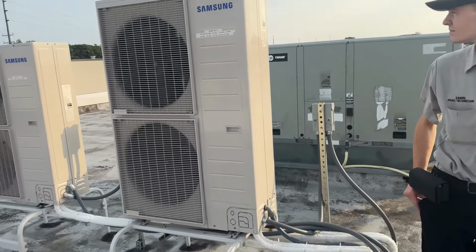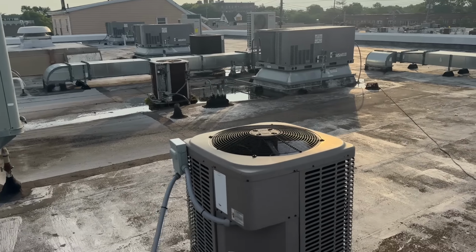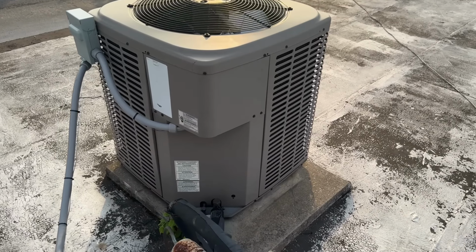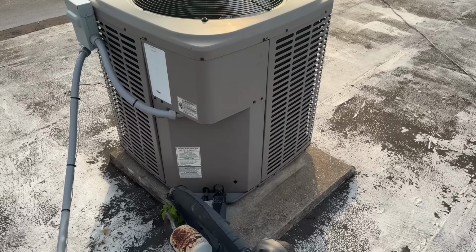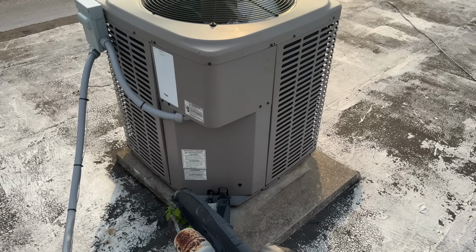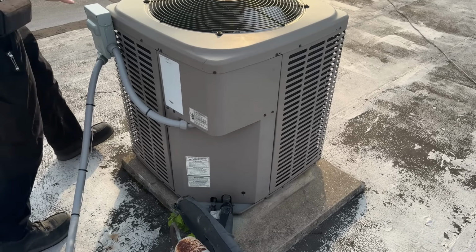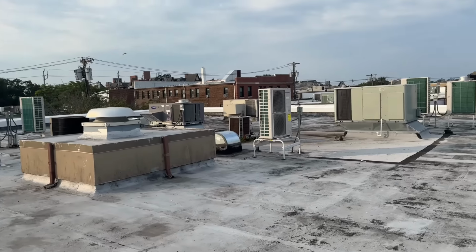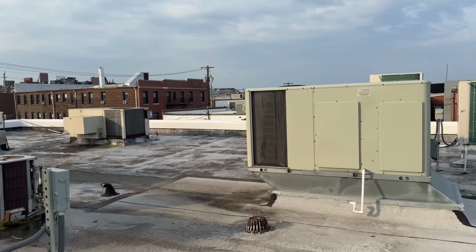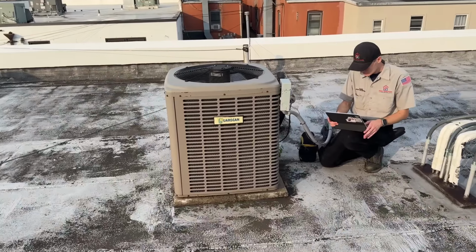What I do know is that the new landlord took over the building, renovated it, and I guess stuck her with this while everyone else got new equipment. It stinks. Yeah, it does stink. I would say there's pressure in it. What? There's some pressure in it. Is there? Yeah. I would say we get some gauges, we get some tools, and we just check to see if we have a good standing pressure. But I got a feeling we're going to be low on refrigerant. That sucks. All right, so by process of elimination, it realistically can only be this one, Guardian microchannel R22 condensing unit.